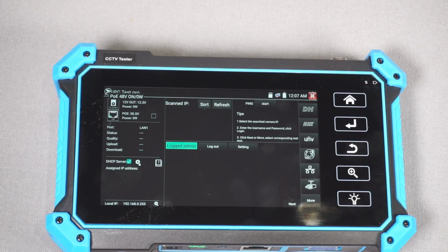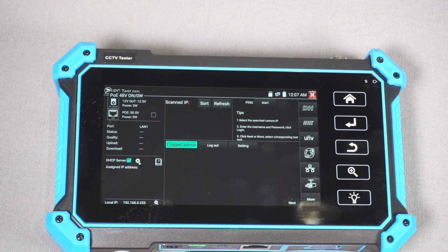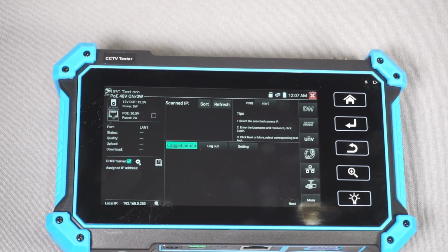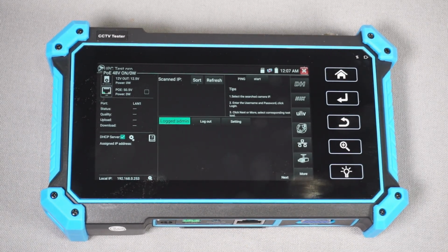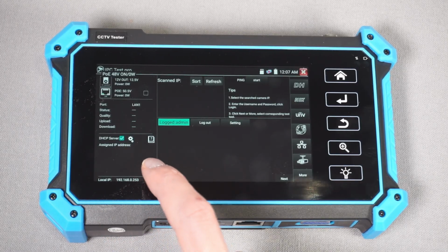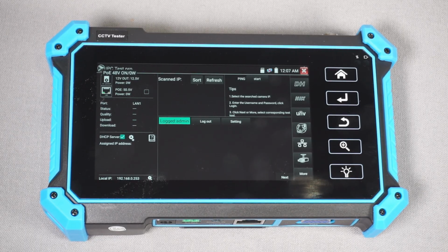The other thing to bear in mind though with this is it does run a DHCP server when you open this application. And there's a couple of other places in it you can enable the DHCP server. So you probably want to be quite careful plugging this into certain networks. Now, if you're installing something in, say, a business environment, I probably wouldn't recommend plugging a cheap device from AliExpress into their corporate network. But you definitely want to be very careful with that if you were, because if you did it, it would probably be fine most of the time. But then if you accidentally open the wrong application and it starts a DHCP server that sits on their network and starts giving out the wrong IPs to a bunch of devices, you might not be very popular.